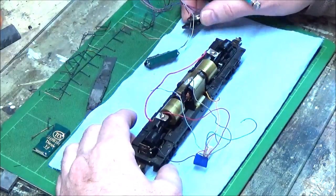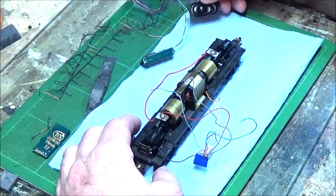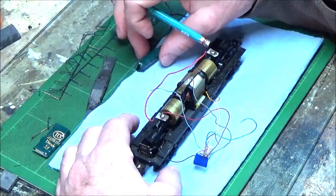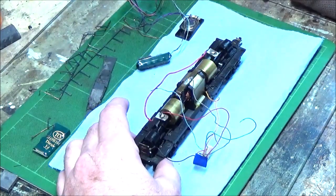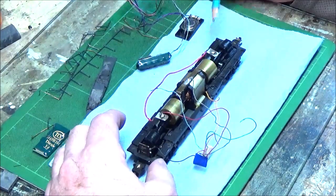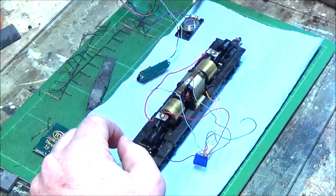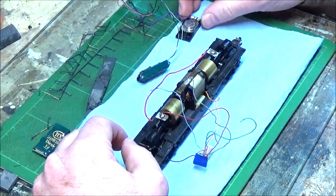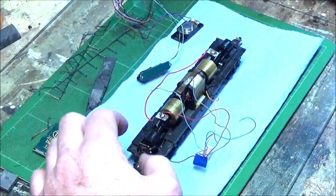I haven't had the greatest luck with the sound quality from oval speakers. I don't know if it's just because they're not symmetrical. What I'm going to try is I've picked up some iPhone 4 speakers. So I'm going to try one of those, I think, on this model. So the Keep Alive will get reused. I will probably unsolder these or just clip them off. The purple wires for the speaker, and that'll get reused.